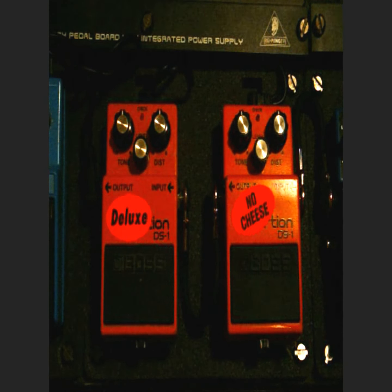The tone and the distortion are pretty much straight up at 12 o'clock. This mod made the pedal a little bit louder. I found that changing the clipping diodes to LEDs does that for some reason, on the DS-1 anyway. So the level is down just a little bit. I'll come back to this one.